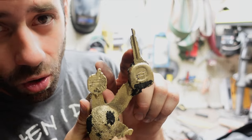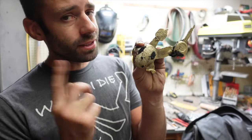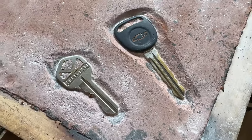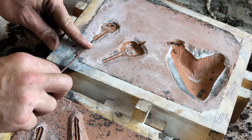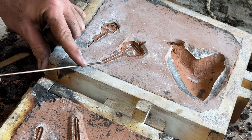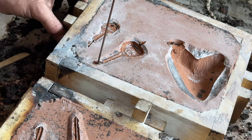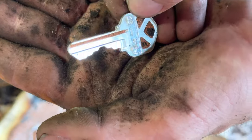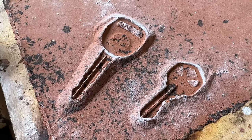My truck key almost turned out, except for the last little tip. The house keys didn't work at all. So I'm gonna try again, but this time with some heftier venting — I didn't think I'd need to, but I guess I do. The next attempt looks just like the first, but this time I'm gonna take a welding rod and make a little channel that'll help air flow out of the void. Once again, the sand didn't pull cleanly from the key, but let's first get a key of any kind and then we'll figure out how to make it work.